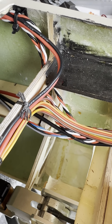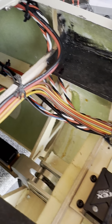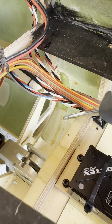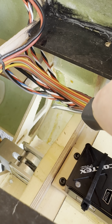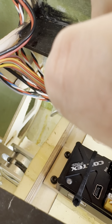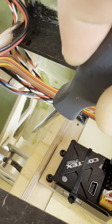This is the nose gear — the nose is torn out, but it didn't tear anything, it just basically came apart at the glue joints. What I found is this, and you can see it. It's hard to see from this vantage, but you can see the edge of the wood where it touches the skin. Where this brown is, that is wax that has soaked into the wood at the glue joint — actually where the wood is touching the skin. They put glue on both sides, so I don't know why there's even wax on this side because your mold release should be on the outside.